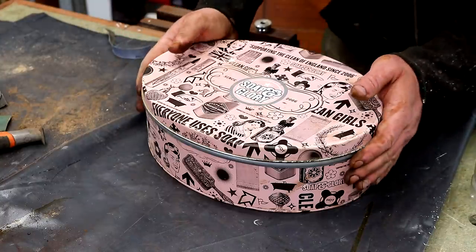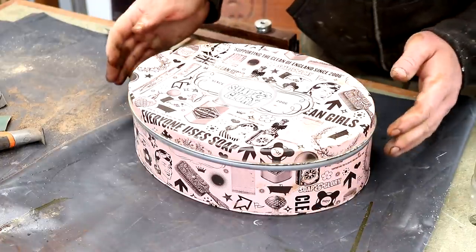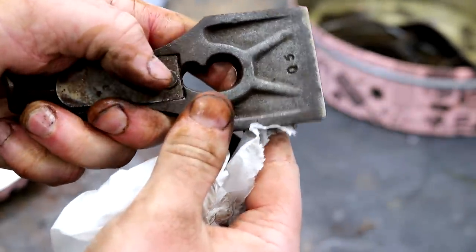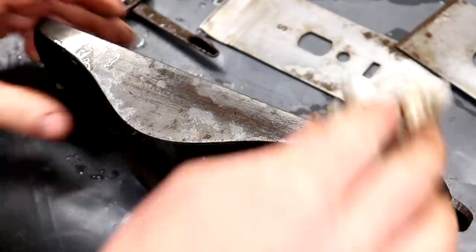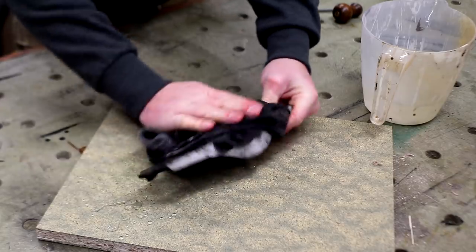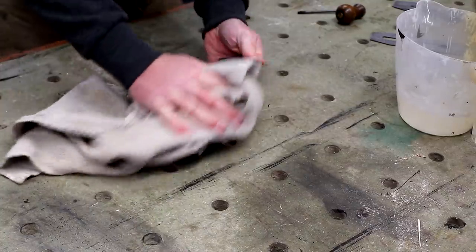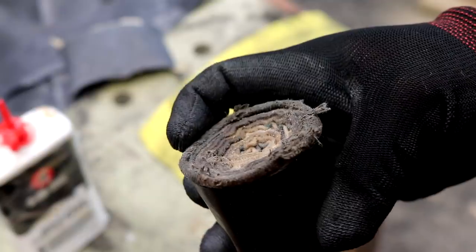I left this a couple of hours and my container doesn't seem to be quite watertight, but it's not leaking too badly. My random vinegar solution worked really well — the rest of the rust just wiped away really easily. Then I washed all of the metal components in warm water to clean off the vinegar, otherwise the vinegar is going to continue to eat away at the metal over time. Then I thoroughly dried everything off and applied a thin coat of oil using my oiler, which is an oil soaked rag tightly wrapped up inside a spray can lid.